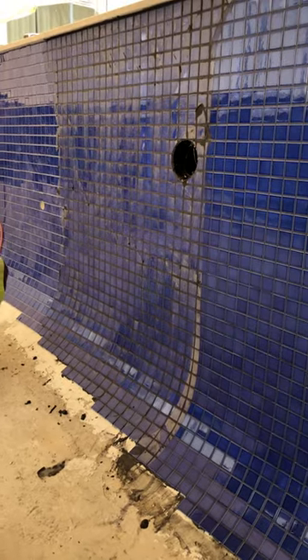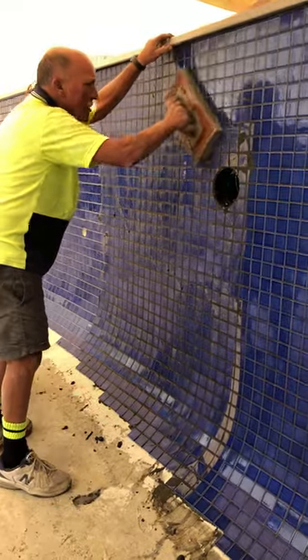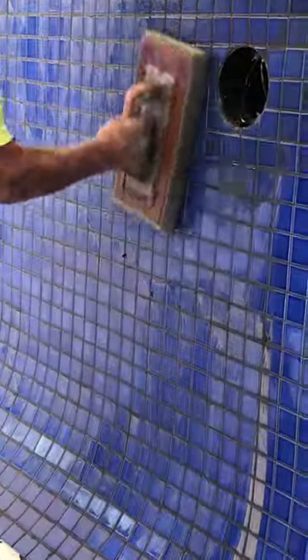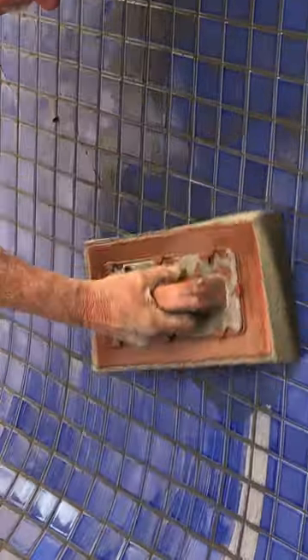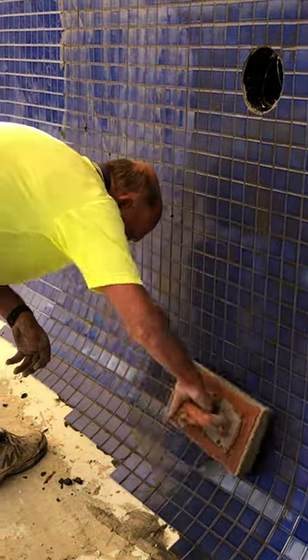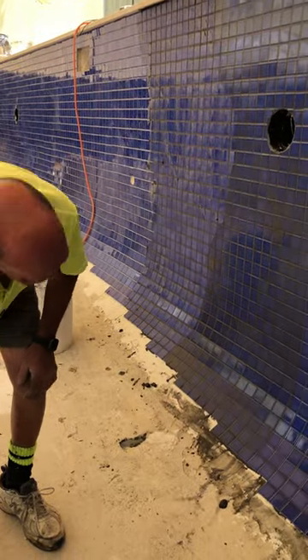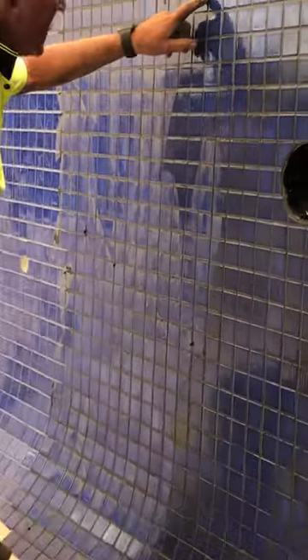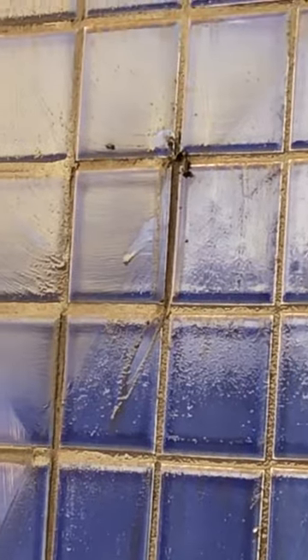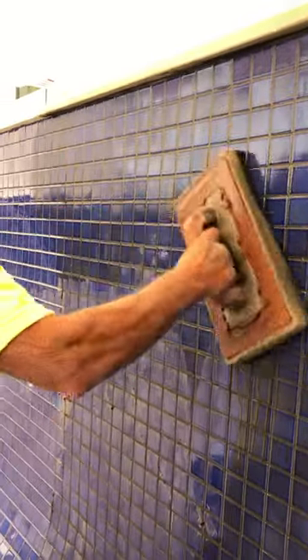Now that's all ready — we'll leave that and that'll dry, and we'll be able to buff that. On this again we've got our rough-up wash. I pay particular attention when doing this to make sure that the joints aren't overloaded with grout and that it's coming up reasonably even. Notice here I haven't completely filled that joint, so I'll just take a bit more grout and put it in. If you do things and you see them, you can't go wrong.